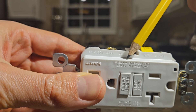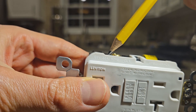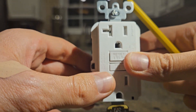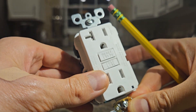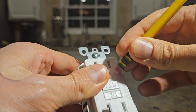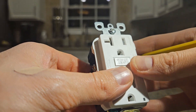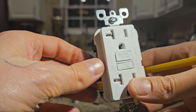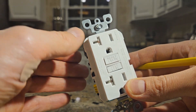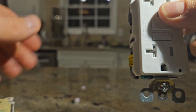It's always super important to check the specs of your outlet by looking at the actual outlet, not just the box — sometimes people return things and stores resell them. The outlet itself will state whether it's 20-amp or 15-amp. Always check your breaker: if the breaker is 15-amp, use a 15-amp outlet; if it's 20-amp, use a 20-amp outlet. To keep it simple for the DIYer, just match your outlet amps to your breaker.